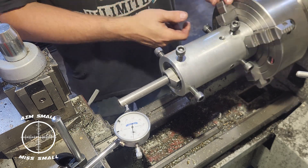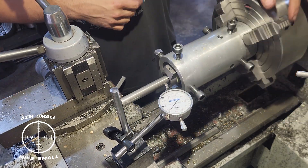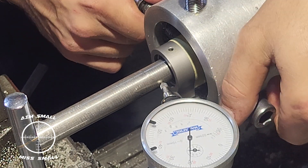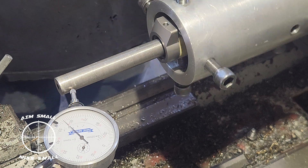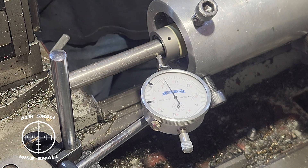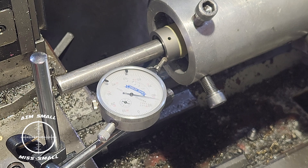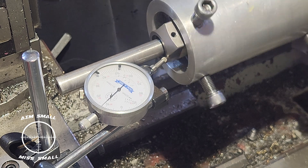He's starting the process — the barrel has already been taken off the action. What he's doing now is aligning the centerline of the action to the protruding rod, and he's using a measuring gauge to make sure he gets the centerline exact. It's quite a little bit out, but he is tensioning the screws on the right hand side to reduce that. At the furthest point away from the action we went with a 0.1 millimeter tolerance. Then he moves the measuring equipment to measure the front face — as I mentioned, I had a 0.4 millimeter spread there.